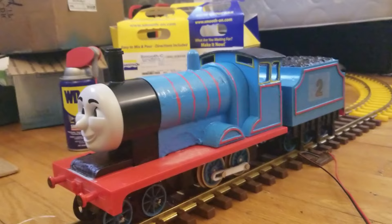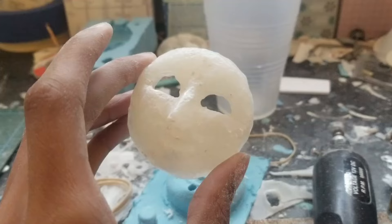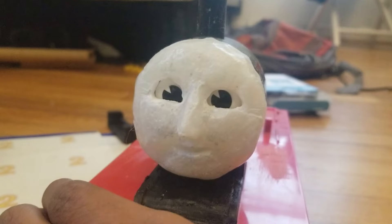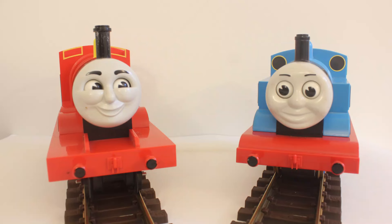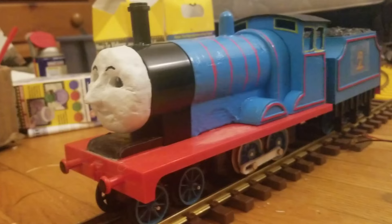Right from the beginning, I was very adamant about changing the face, as otherwise it would just be James painted blue. However, because there are no models of Edward in G-Scale to pull the face from, I had to create a custom face from scratch. And because I wanted it to work with the other Lionel models, I also had to make the face compatible with the eye mechanism. There was much trial and error — I would sculpt the face out of clay, make a mold, and then cast it, repeating this process and refining the face with each sculpt. I wanted to mimic the low detail of the other Lionel models, so I used the Tomy Edward's face as a basis. Once I finally got a face I was happy with, it was painted up and placed on the smoke box. The model was now fully complete.